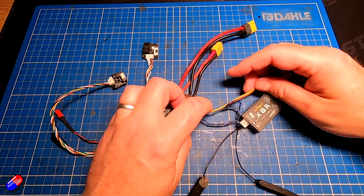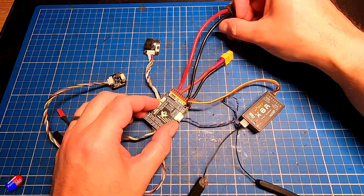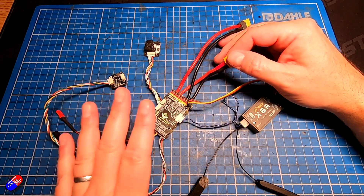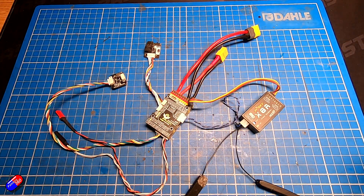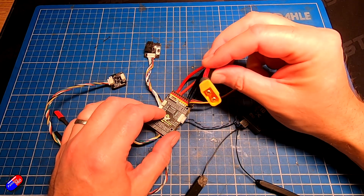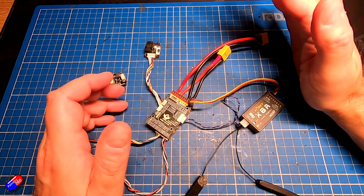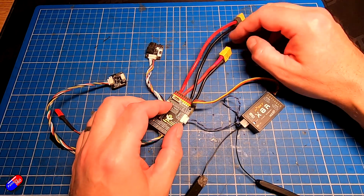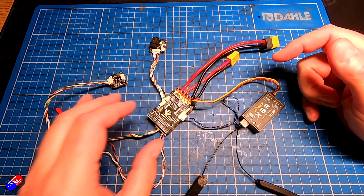For ease of installation, sometimes I do this: rather than directly solder the ESC to the flight controller — because I sometimes move these rigs about — this setup actually lives in a box on my bench. I have a couple of them, and when I want to add iNav to a plane, it's kind of all ready to rock and roll. I have added XT60 connectors — one to go to the battery and the other to plug into the ESC — so I don't have to unsolder everything. Unfortunately, those things have had to be soldered on, but if you can do all this on the bench, it's much easier than trying to do it later.